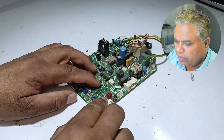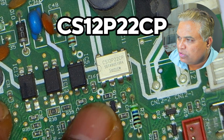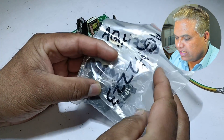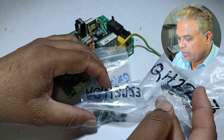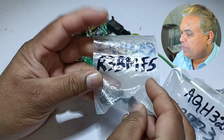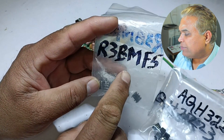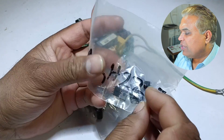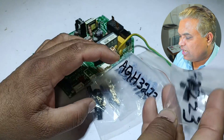This model of the circuit board comes with different numbers of triac. I have three different triac numbers — any one of them can be installed on this circuit board. The number of this IC is AQH2223, the next is AQH3223, and the third IC is R3 BMF5. The AQH2223 and AQH3223 have a 1.2 ampere rating, while the R3 BMF5 can bear a load of 0.9 amperes. The more amperage, the less the chances of the IC going bad quickly.